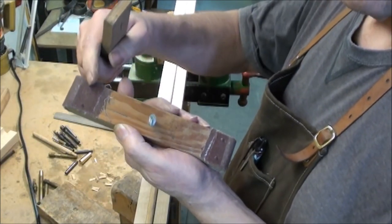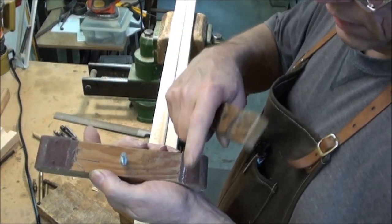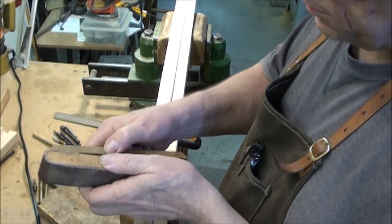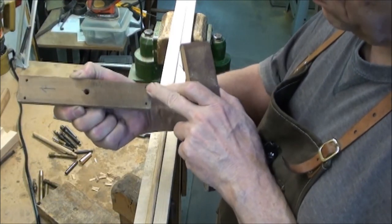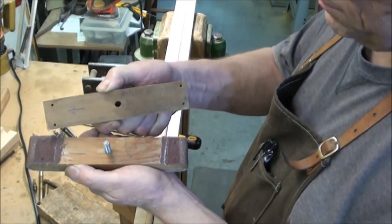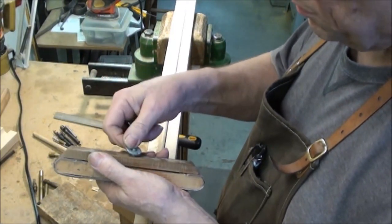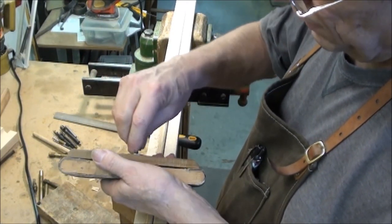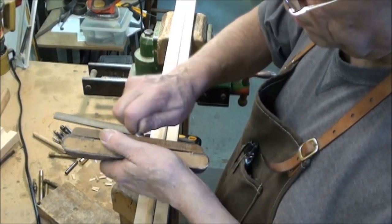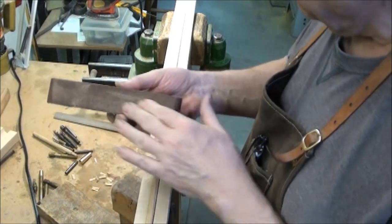It's got a couple of pins on either end here that I can fold the belt around. Place it in place, clamp this down. It's got corresponding holes on the other end, and I do have a locating mark here so I know which end is up. And then when I tighten it down, of course, it holds that piece of belting in place. And I usually keep a layer or two on there to sort of pad it. This one's got three layers right now.